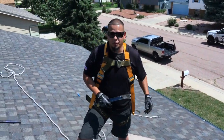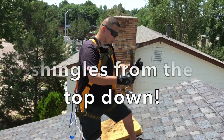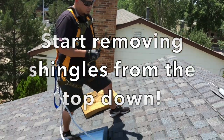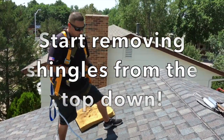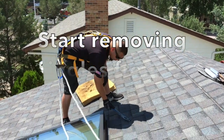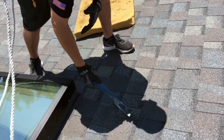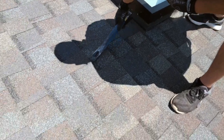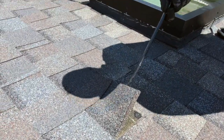For this repair, you always want to remove the shingles starting from the top, working your way down. It's a lot easier — once you get the top one removed, all the others are exposed and it's easy to remove those nails. One thing you have to do is if you want to remove a shingle, you have to actually remove the nails on the shingle above it, because that shingle is nailed up there. To do that carefully, you can use a putty knife, a 3-in-1 tool, or a flat bar like I am.